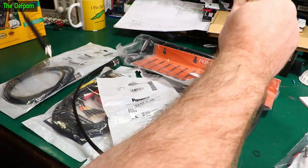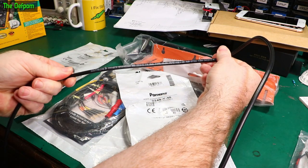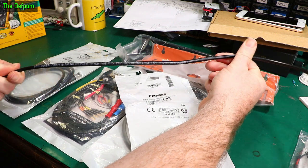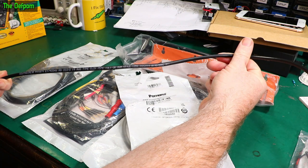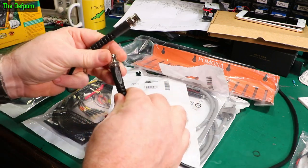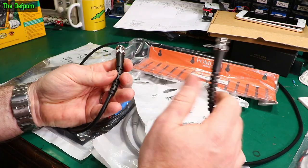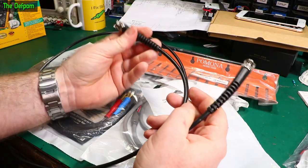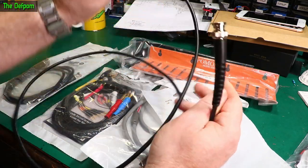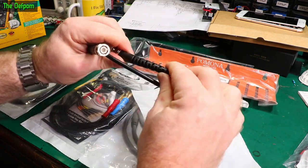You can see the labelling on here. So — Southwire, there's the model number: RG223U, 19AWG, 75 degrees C rated. And Pomona-branded plugs. Nice strain relief on there — that works nicely. It's obviously coaxial. Strain reliefs are important — that's quite nice. You could end up cracking the coaxial cable without them.